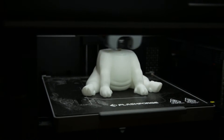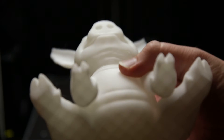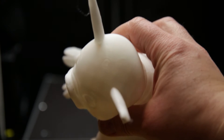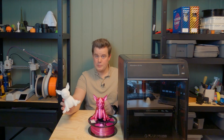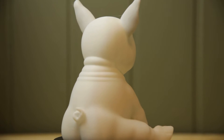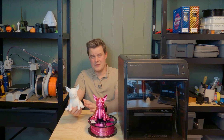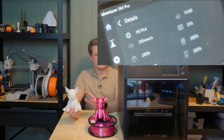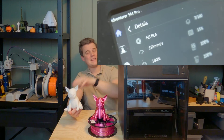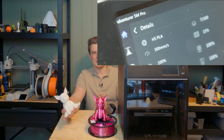The quality is really nice. I tried to get it under two hours but didn't manage. You can see some cooling issues under the chin but that's only on one side — other than that it's really impressive. This is 150mm high, so if you want to try this on your printer, run it as fast as you can with default 0.2mm layers and see if you can come under two hours. It's not doing 300mm/s extrusion all the time — mostly around 200-250mm/s, sometimes up to 300. Travel is at 600mm/s, so it's super fast, but not always 300mm/s.